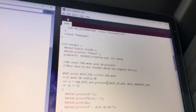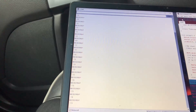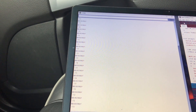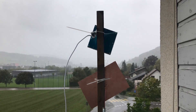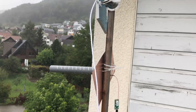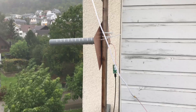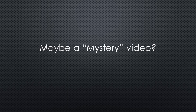Unfortunately, both Wi-Fi modes did not work anymore at 4.7 km. On my way back, I stopped at 1.5 km — both modes worked with a directional patch antenna, but I had no reception with the PCB antennas. An interesting detail: the RSSI value of regular Wi-Fi is higher than with the long-range mode, even using the same board and antenna. The long-range signal is transmitted by the patch antenna and the 11b signal by my long helix — maybe longer is really better? I decided to investigate this mystery later, perhaps even in a video.